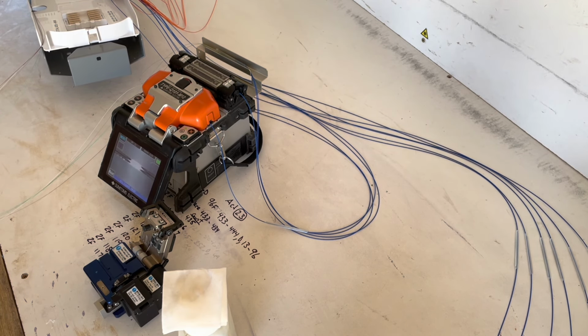All right, so we have our single splice chip here, in which with these you have to alternate back and forth. This end will go in up top, the next one will go in down low, and it does it on the opposite side, back and forth. If you try to just jam the splices straight in there, you will not fit them all. It just will not fit. So start with your first one, green. One side's up, one side's down. Back and forth, back and forth.